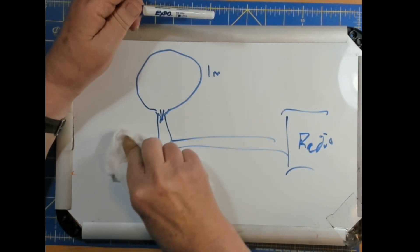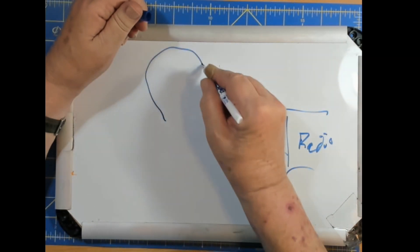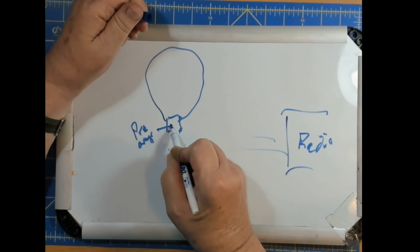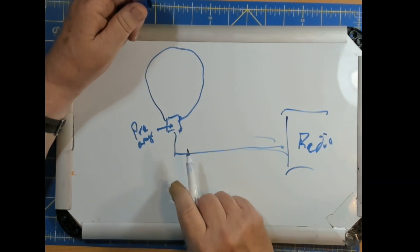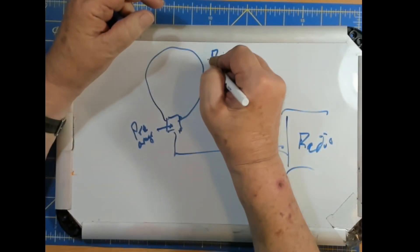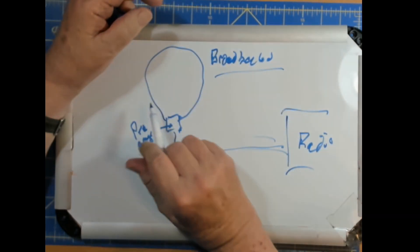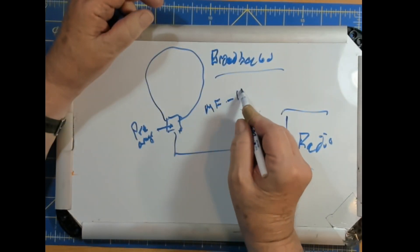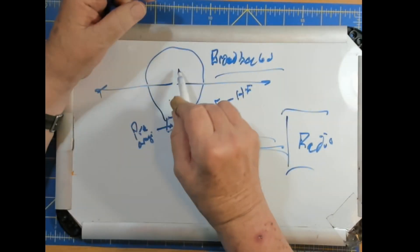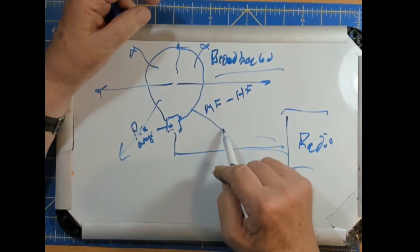So that works and is probably more along what you're looking for. Now, the way these antennas are actually made is with a preamp that goes right in there, and then the output comes out over here. The preamplifier makes this extremely broadband. You can leave out the capacitor and have a very broadband antenna that can receive basically medium frequency to high frequency. Now this antenna is directional — its pattern is actually off the ends. You can actually lay these over on the side and have an omni antenna.